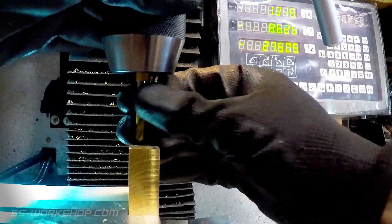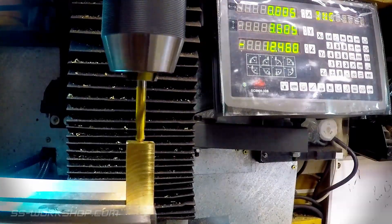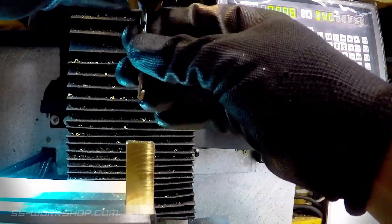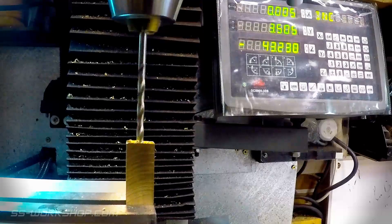The spotting drill is then loaded into the drill chuck with the position located on the digital readout. The hole is then started with the spotting drill, followed by a 4.5mm drill, then a 4.9mm drill, leaving excess material for reaming to 5mm.